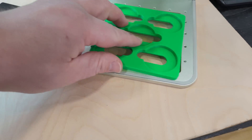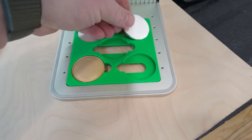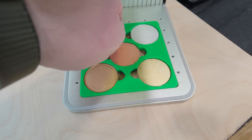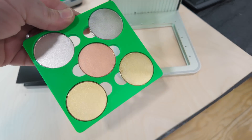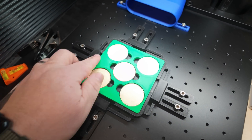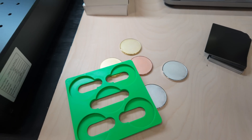Sam's tip number four is all about performance enhancement devices — jigs, fixtures, fences, whatever you want to call them — the things you add to your laser to hold items in place. Whether you're doing laser engraving as a hobby or a business, if you ever find yourself engraving more than one of the same thing, a jig is your best friend. They give you increased efficiency when batching jobs and the ability to have repeatable outcomes. If I have a jig set up, engrave, move it, and bring it back — that repeatability gives you a return on your investment over and over the more you use it.